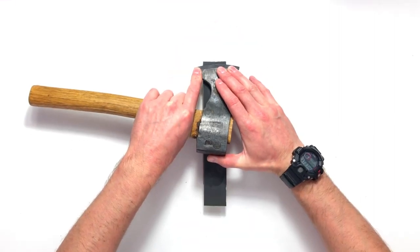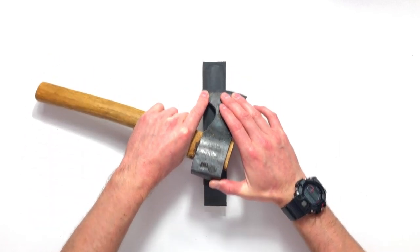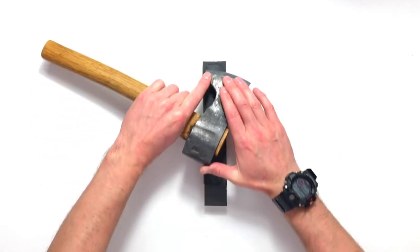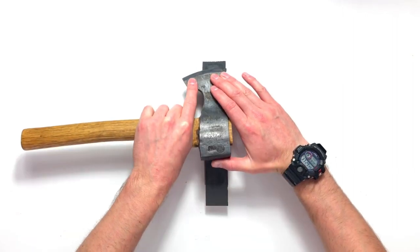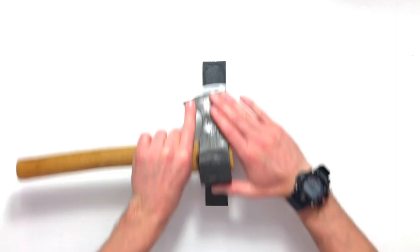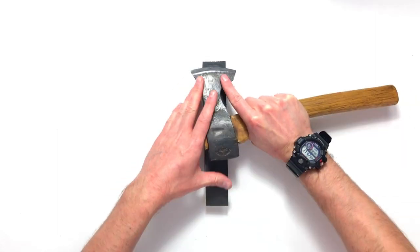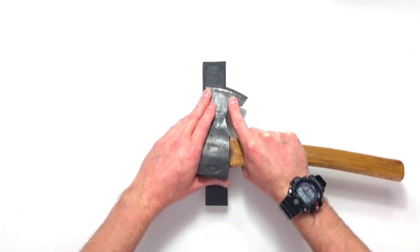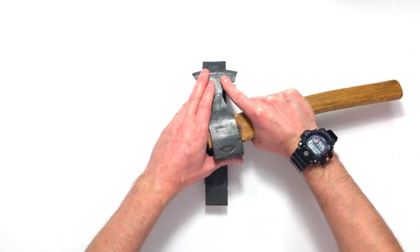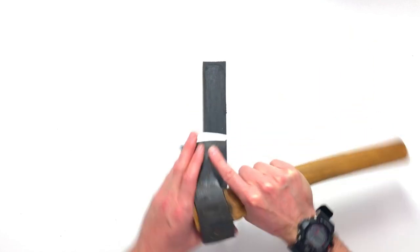We're going to do the other side now. Find that bevel from the middle, going down to the heel, then coming up to the toe — doing it in single passes because I've got the most amount of control. Make sure we push that burr all the way back. This is the best way to keep these bevels flat. As soon as you start trying to do twisting motions or trying to do everything in one pass it's almost impossible to keep it flat.